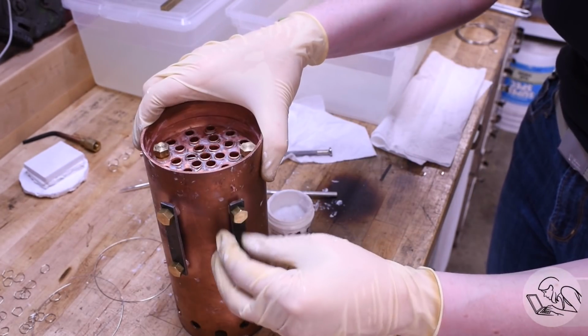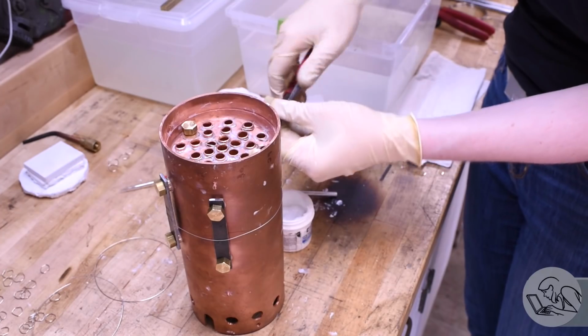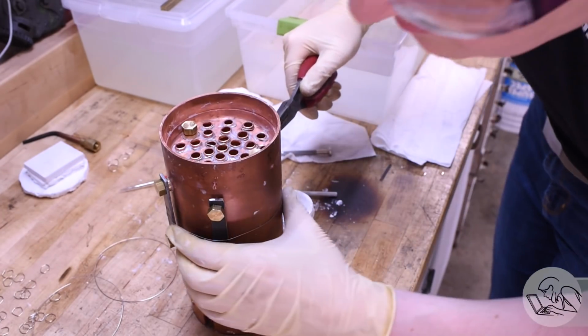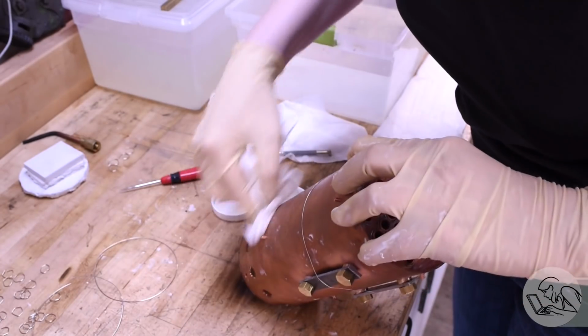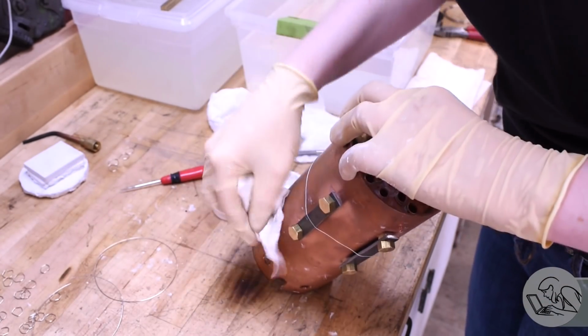And the fixture plates are tied in with titanium wire, as I described last time, and then of course a ring of solder goes around those bushings as well. And then those big rings of solder go around the tube sheets. Now the solder's only been applied to the top tube sheet for now because you always want to have gravity working in your favor when you do this.